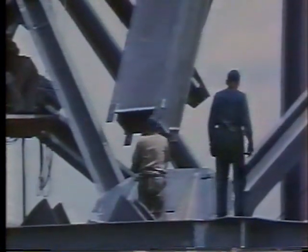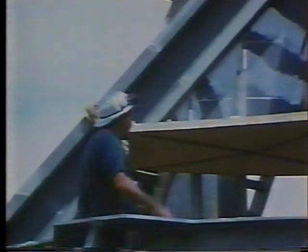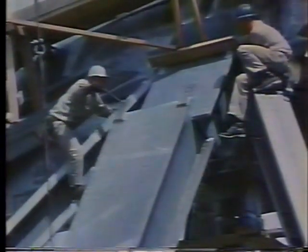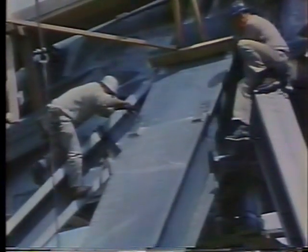To our knowledge, the overall tolerance of plus or minus 1/8 of an inch on such a large structure has not previously been attempted or accomplished by welding aluminum in the field. We were fortunate that highly skilled craftsmen and very delicate construction equipment were available to build this component.